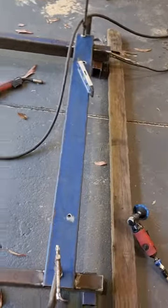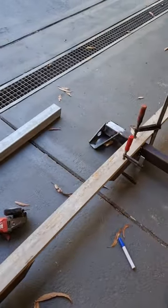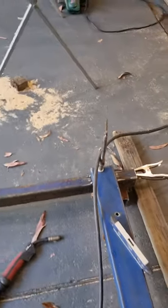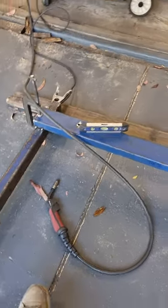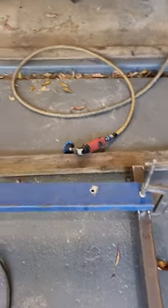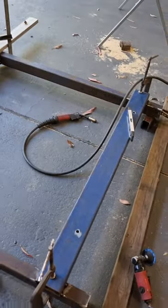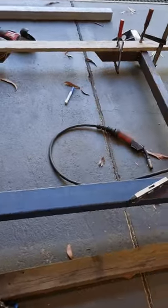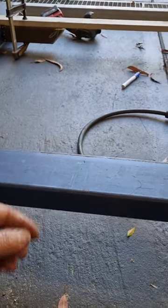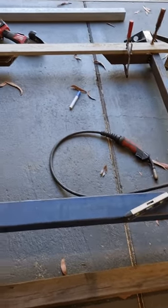I'm using the steel that I had. So this is the rear brace, so that's the front, driver's side, subframe. And then this part, this is massively oversized, but it'll do the job. It's 50 by 100. And what I've done, I spent a lot of time working out the position for it. So the hump on the chassis goes just in front of it here. So this sits about 15 mil in front of that, so it'll never contact it. If it settles, it won't hit anything.